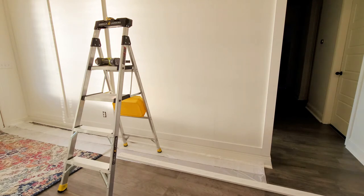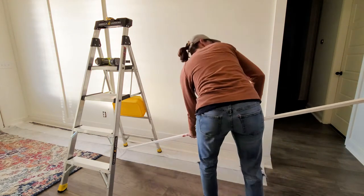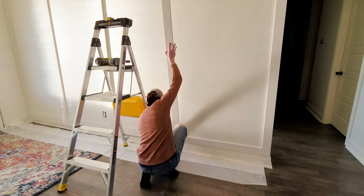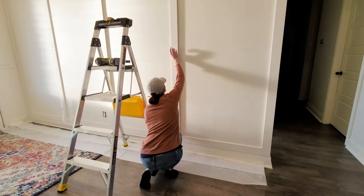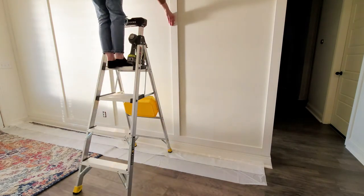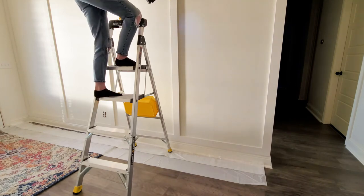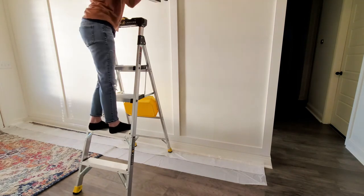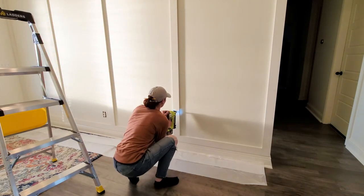The last board gives me the entire shape for the wall — it's four panel and perfectly framed between all the original molding. One thing I wish I had done is give all my MDF trim boards a nice sanding. It helps remove roughness from the primed MDF boards and can prevent possible injury. Once I primed the wall, I could really see the rough edges, so I had to sand them and touch up with primer.